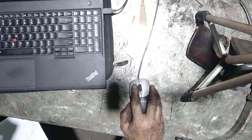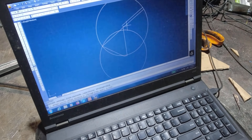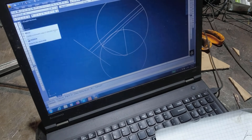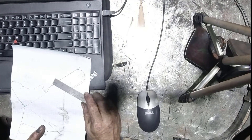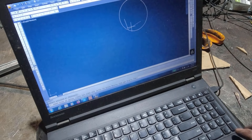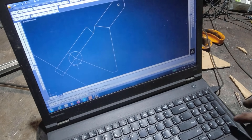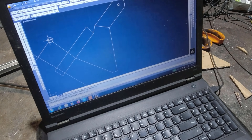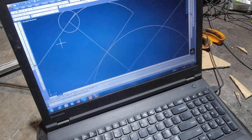I'm doing basic triangulation. You start out with a regular height, an offset, and then everything is drawn by circles — you just connect wherever they intersect. This top piece is offset by three-eighths of an inch off the straight where it intersects, and then it kind of just builds itself. In order for the plasma cutter to cut out circles, you draw your circle, break out a segment, do a lead-in and lead-out, then polyline edit and join — connecting your lead-in and lead-out to the circle so the machine can realize it's cutting a circle instead of just a point.